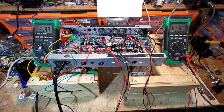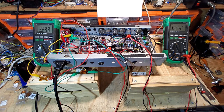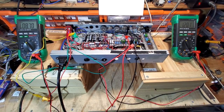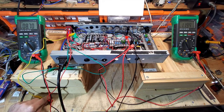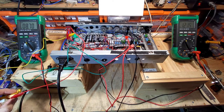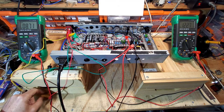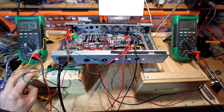And the output tubes are 16.5 volts, and we've got those wired in parallel. Now there's two problems. One is we knew when we bought this transformer we got a little bit more voltage than we needed. Secondly, I bought a 40 watt transformer, and I'd probably have been better off with a 30 watt one. We've set this up ready to balance these heaters. If you're in the States, we generally call them heaters over here for some reason, but never mind, filaments will do. We've got a 10 ohm resistor there at 25 watts, a bit overkill, but the 15 watt one I used was getting a bit warm, which is why I went for that.